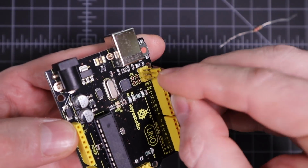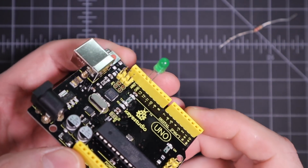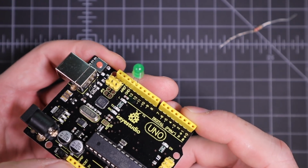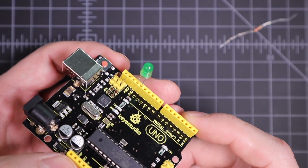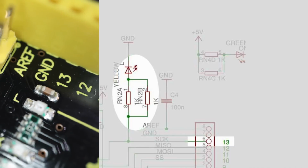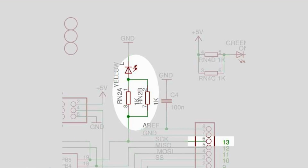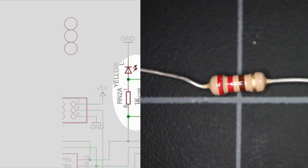In many of the Arduino tutorials on the web, they will show wiring the circuit without a resistor and attaching it to pin 13. They will claim pin 13 has an integrated resistor. This is true, but their assumption is wrong. The resistor is wired in parallel to pin 13 and only protects the integrated onboard LED. If you follow those tutorials, it is possible you will ultimately burn out the LED, or even worse, fry the Atmega microcontroller. Don't do this, use a resistor.